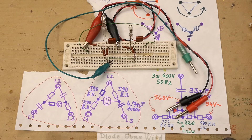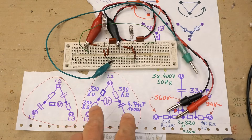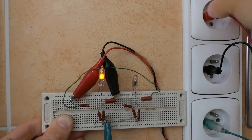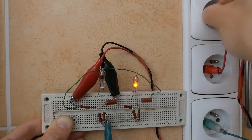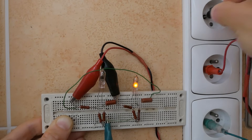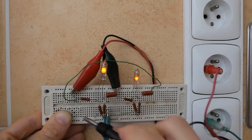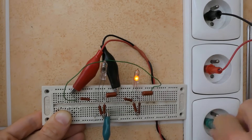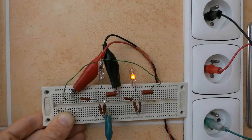You probably want two lamps, one for each direction. To do that, build the circuit twice — one mirrored — and put them on top of each other, sharing one phase with the other two reversed. One of the two lamps lights up; if any phase is missing, both light up, giving a clear indication of a missing phase. Swapping two phases makes the other lamp light up, and again any missing phase lights up both. Even replacing any phase with neutral, or connecting one phase to another, still gives you two lights indicating something is wrong. So if just one lamp lights up, it indicates the direction and confirms you have all three proper phases.